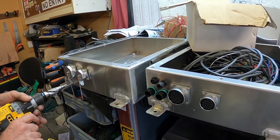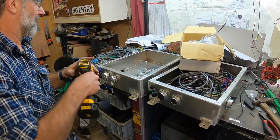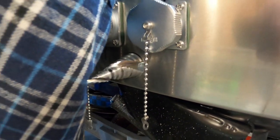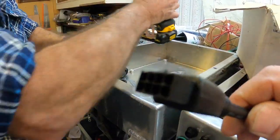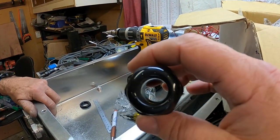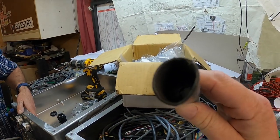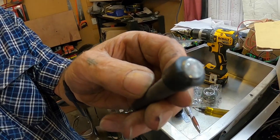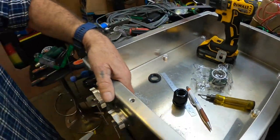We're just chucking all the plug holes in the fitting. That's the hole for the Y band - as I was saying, they've got a moulded plug on it already, so we're going to have to use this big thing. But in order to get it to seal, we'll put some of this heavy wall heat shrink on - it shrinks down and leaves quite a bit of meat so it will be able to grab around it. It shrinks down to about that, so we should be able to grab inside the seal and keep it watertight.